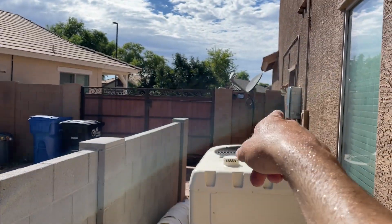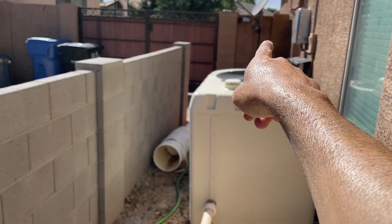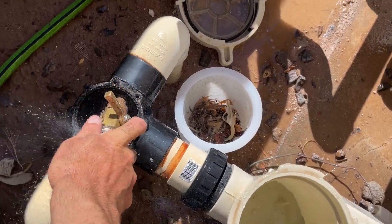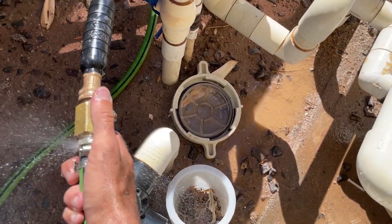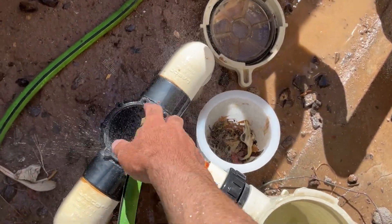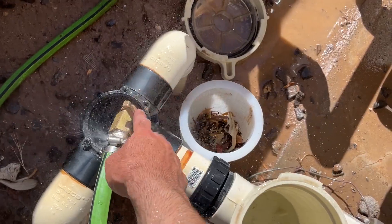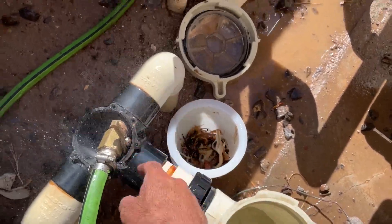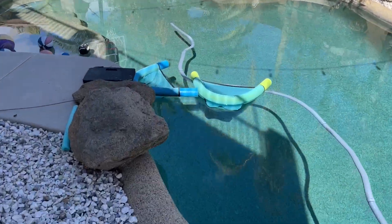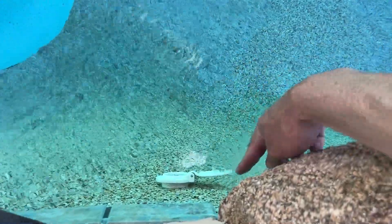Basically just coming off the main hose spigot from the main water line, because that's going to give you the most pressure. Running a hose down here — I've got this drain bladder right here hooked up to a shutoff valve. Sticking it in there. I've got my Jandy or my Waterway diverter valve, faceplate taken off, going into the vacuum port here. You've got to take off your hose from the wall and leave your vac lock in the open position.